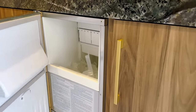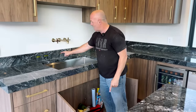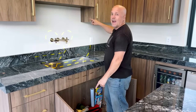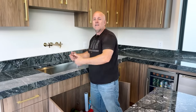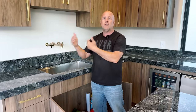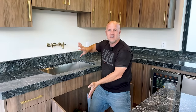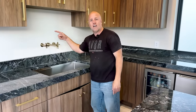And then I took the hot water loop, because I have instant hot water everywhere, that's already hot. The loop that loops through the whole house, I actually brought up, wrapped it around these lines, down around the P-trap and back out. So not only do I have a conditioned space that's heated and air conditioned because it's in the house and coming out here, but I ran a secondary backup to that by running the hot loop through it. So I have two heating systems heating that. So essentially, all this is indoor. So I can run it all winter long, 10 below zero. I have hot and cold running water.